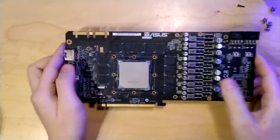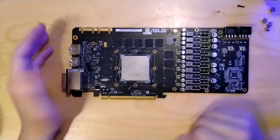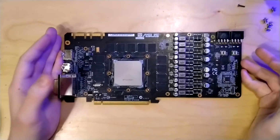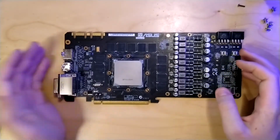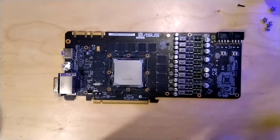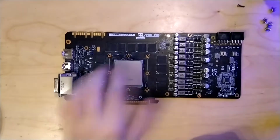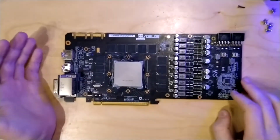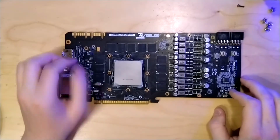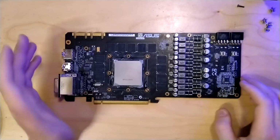Now, why don't we see this today? It's probably for the same reason why Gigabyte put them on the back of their VRM. It's because NVIDIA and AMD probably don't really want board partners to mess with their capacitors on the back of their GPU. Like, if you look at several GPUs, they will almost always have the same setup of capacitors at the back of the GPU, which is probably because AMD and NVIDIA don't allow board partners to change anything about that region of the PCB.